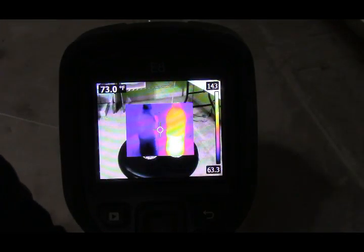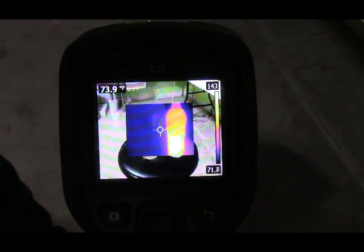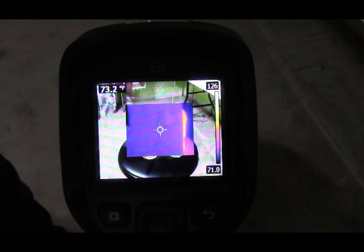The bottles are blocking the IR. The reason you're seeing the cold or the hot is because they've already heated or cooled the outside of the plastic — the heat has already transferred through it. First thing we're going to run in front of it is that eighth-inch cast acrylic. You can see it coming in. Everything is disappearing. But visually you can still see through it — you can see my hand, you can see everything else. Visually you can see it; thermally you cannot. It blocks it.